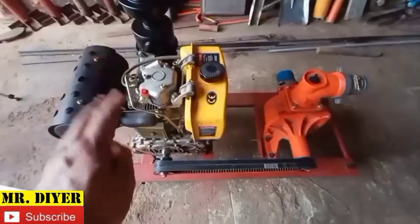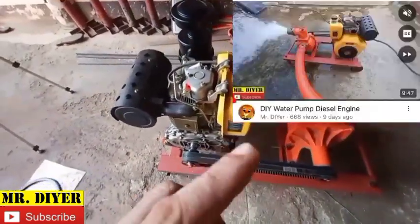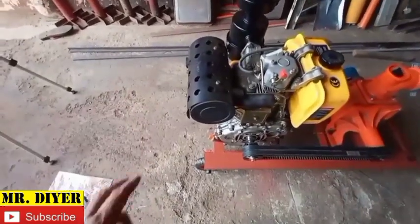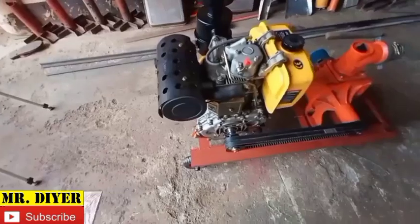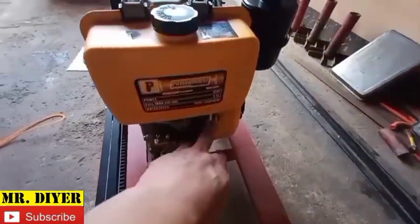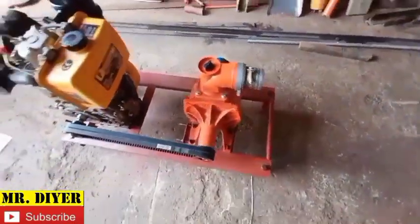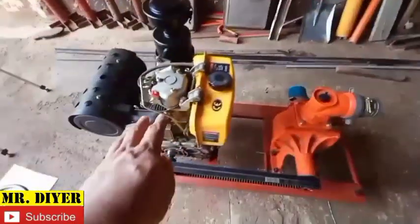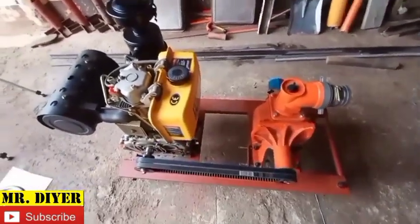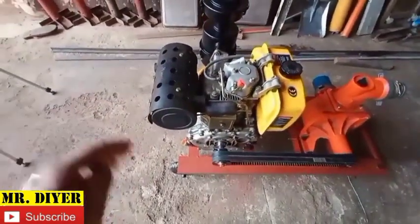This is too loud, but maybe as this project progresses — like I've said in this video — I intend to add an alternator or generator, at least 7.5 kVA or maybe 10.5 kVA, depending on what I can afford. This is an 18 horsepower engine, which only requires at least 6.5 kVA, so this engine is more than enough for that.